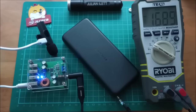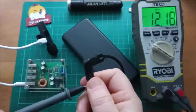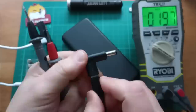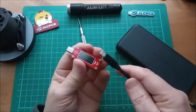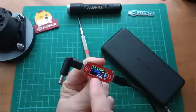Next thing is, is that 12 volts? Let's get my DMM. Positive is the centre pin. Let me turn the light on - quite nice these DMMs, very visible but strange. And the voltage is 12.1 volts. So yes, this is just a little device that sits on the end of your USB, tells the power bank 'I'd like 12 volts on this occasion.' You can buy these in different voltage ratings. It says '12 volt PD' on it. And 12.17 volts confirmed.